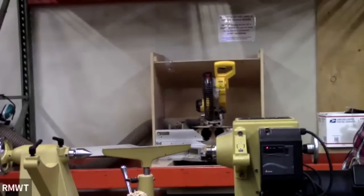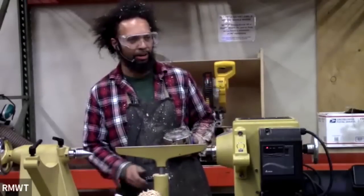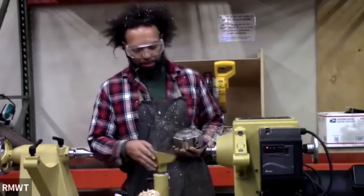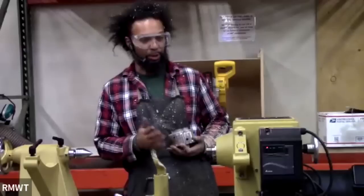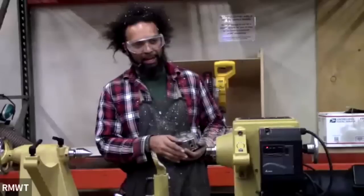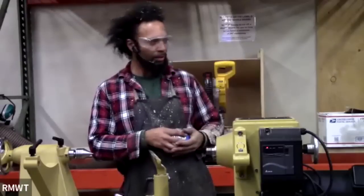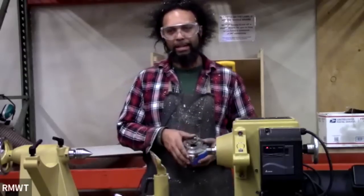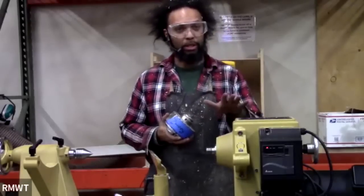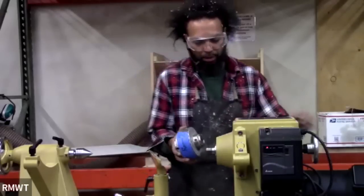So now we'll go ahead and chuck this piece up. Yes, entirely. And I use a term that would be, I say, lead with the bevel, which is to say that I'm not roughing a piece down and just basically inserting the edge directly into the wood. I never, ever do that. As long as you have a blank, as long as you have a square, square to me isn't a blank. Something that's round that you would buy in Woodcraft, those aren't blanks. Those are hunks of wood. And so let me make a distinction. A hunk of wood, whether it be square or round stock, needs to be trued up entirely before you can actually start leading with the bevel to then raise the handle to effectively shear slice the fibers. So that's just a terminology I use.